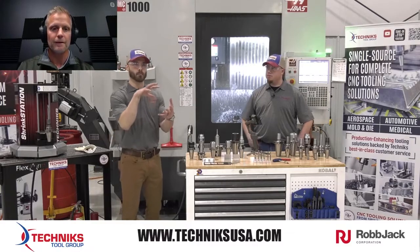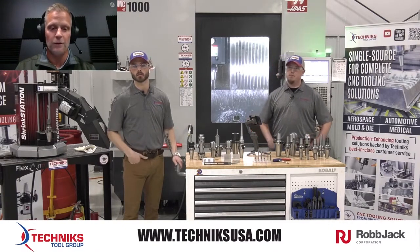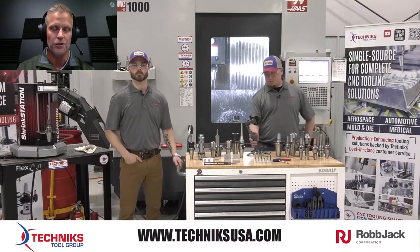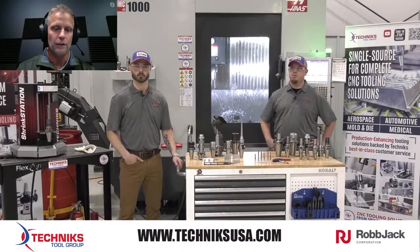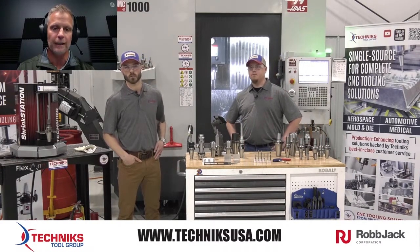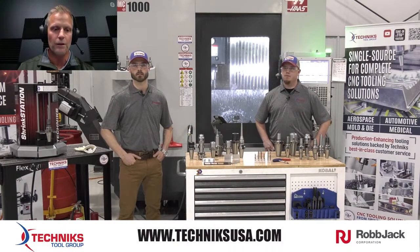Why are we going to use a micron milling chuck versus a shrink fit? We have a lot of customers all the way from large production facilities, medium-sized job shops, even small job shops. Not everybody has taken the plunge into shrink fit technology and invested into one of those machines. But they still want the benefit of a really high performance tool holder, and that's really where the micron chucks come in. It's a great substitute for shrink fit — a mechanical version of shrink fit. If shops just haven't adopted that technology yet, or they're worried about introducing heat into the shop, that's really where the micron chuck is going to play.